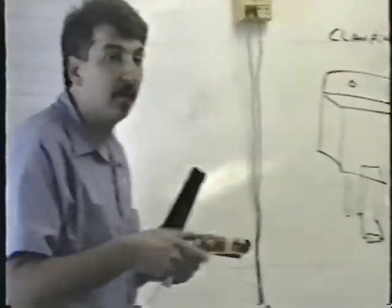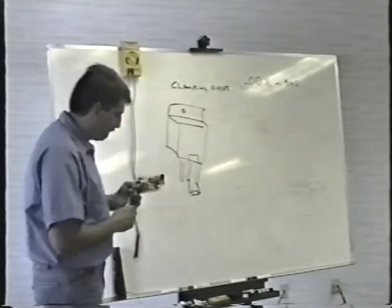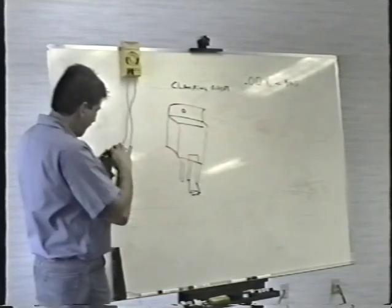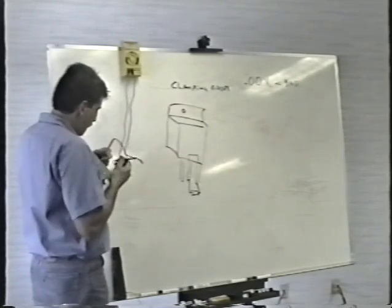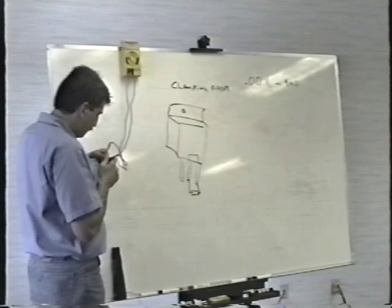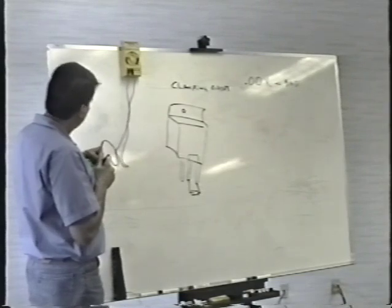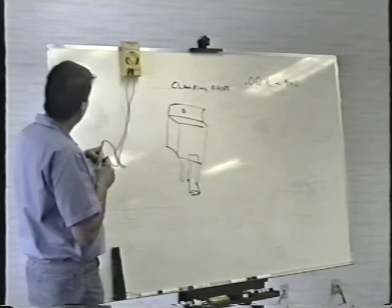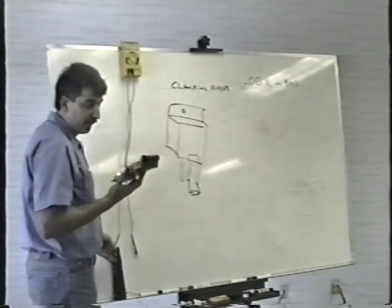Now, I seriously doubt that the bridge is bad in this one because it's very unusual for the bridge to fail by itself. Usually, the bridge fails as a result of something else failing, but let's check the bridge rectifier and see if it's good or bad. And again, since we have a blown fuse in here, what I'm looking for is a short circuit, basically. Luckily for us, when the parts go bad, they almost always short circuit. So let's check. Here's one of the diodes. I see a junction drop. It's not shorted. There's another diode, I see open. It's not shorted. There's another one, junction drop. Another one open, or junction drop, depending on which way I put my leads. No. The bridge rectifier seems perfectly good in this one.